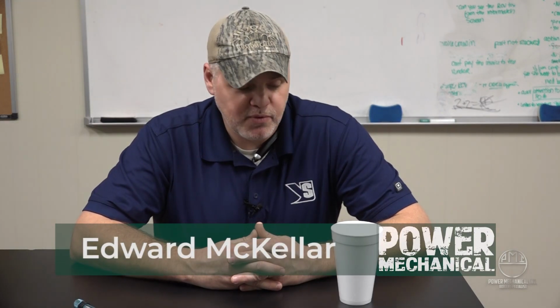I want to give you a quick tip for your boiler room. As you probably know, maintaining an optimum water for your boiler is critical for efficiency and longevity. And one of the ways that you can do that is by monitoring your conductivity or your total dissolved solids.